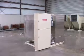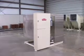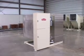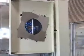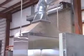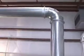Selecting the best location for a Humidaire unit takes a number of things into consideration. A covered location, preferably inside a secured building, provides best protection from the weather and vandalism. In warm climates, fresh air for the burner is critical to strong performance. Avoid locations where heat from press pumps and other machinery can enter the unit. Piping that is too short or too long can hurt Humidaire unit performance. We recommend a distance of 25 to 50 feet for best results.